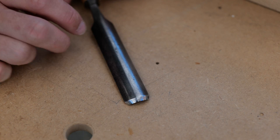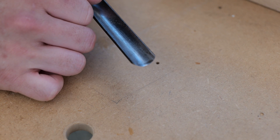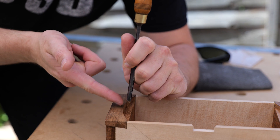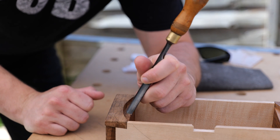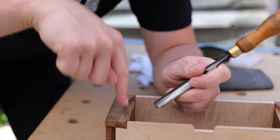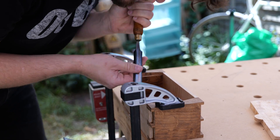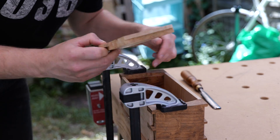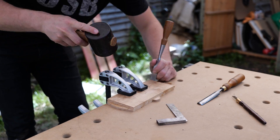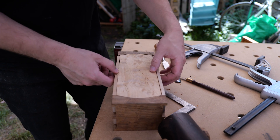Some of you may have noticed in the last episode that the gouge I'm actually using has a bevel on the outside as opposed to the inside, which is not ideal. With the bevel on the inside I'd be able to just go straight down like this, but because the bevel is on the outside I'm having to angle it to match that bevel while going around — which isn't too difficult, but it makes it hard to get that wall a perfect 90 degrees.